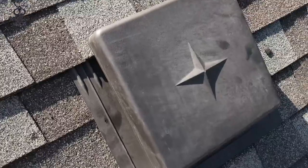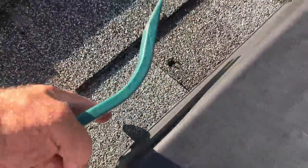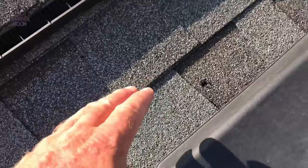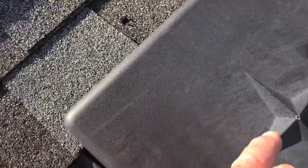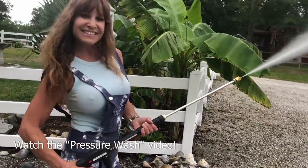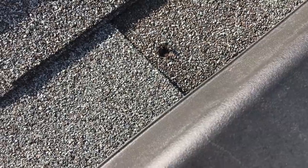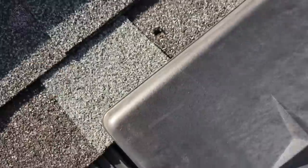This is a great teaching moment — I can teach you from my mistakes. I went a little too high. I actually want that two shingles down. What you should do — don't do what I do — is measure from the center of your ridge cap down to the bottom of the second shingle. Obviously you want to be as high as you can in your attic with your hole, so come down two shingles, measuring from the center of your ridge to between your third and fourth shingle. That'll give you your hole right in the center and you'll still be very high. This is not a problem — I'll just put some asphalt, seal that, and as you can see my flashing goes over that anyway. I'll seal the hole in the plywood; everything will be fine.